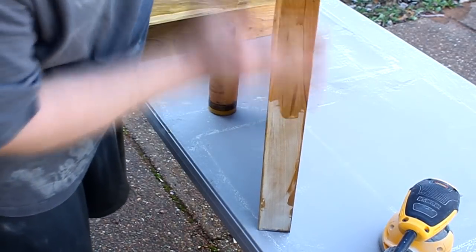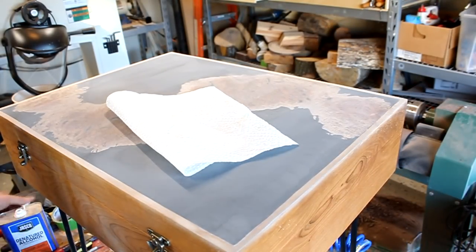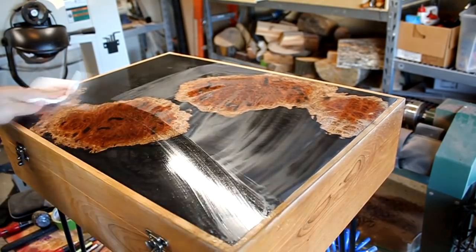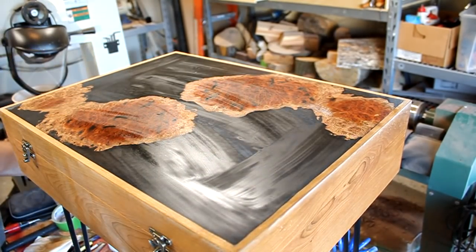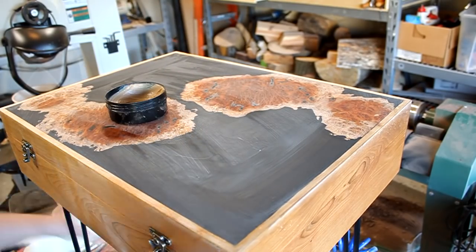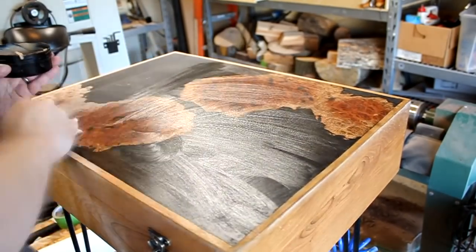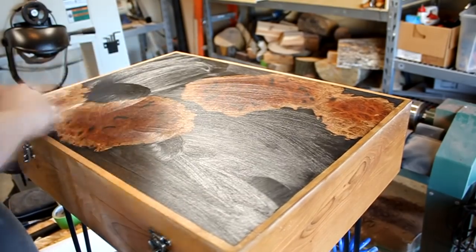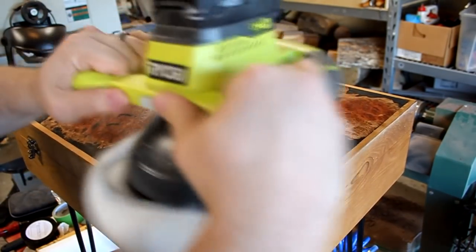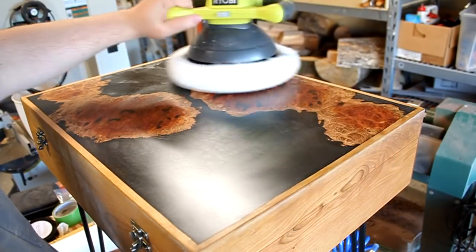You can see the beautiful color on the cherry. So after I sanded it down to 600 grit I wanted to get all the sanding residue and sawdust off of the piece, so I used denatured alcohol to clean it and then I'll be adding a wood turner's abrasive wax. This will further sand the piece - I don't know what the grit equivalent would be but it works wonderfully on my wood turnings so I wanted to try it on this table too, and it worked fantastic. I just added a liberal coat and then got out my buffer and buffed away at it, and as the wax breaks down the grit in it gets finer and finer and really adds a nice sheen to the piece.